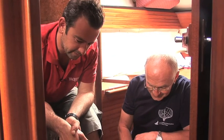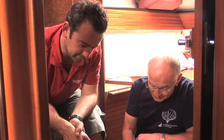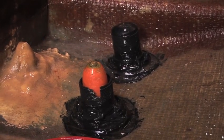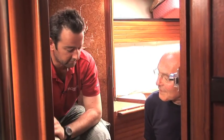It's certainly not a permanent repair by any means, but it's done the job better than I would have expected. So the carrot is winner, but what we have here is an unusual break. Normally the flange will break off outside and the whole fitting comes up through the boat, leaving a clean hole through the hull.